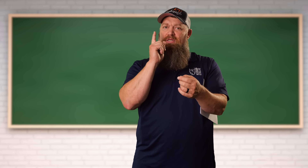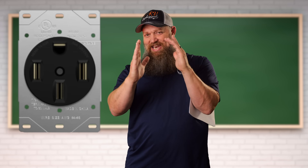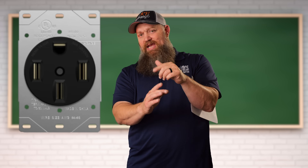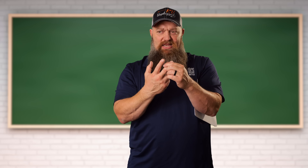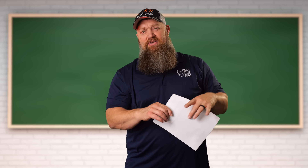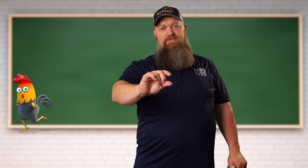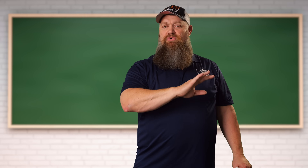That's hot leg one, hot leg two, and the ground — what you don't have is a neutral. Now if it's a four-prong 50-amp plug, you've got a left side, a right side, and another prong down at the bottom. We need to verify if that bottom prong is the neutral, and then you have your ground. If it's four-prong and one of those prongs is a neutral, you've got 50 amps on leg one and 50 amps on leg two — we just need to make sure it's hooked up correctly. Yes, you can plug into it, because even though it's split phase, there's nothing in that Alliance that runs on 240. You have two legs of 120 volts, and if you're running 120 volts you need a return path home, which is the neutral. We cannot share the neutral and ground, which is what many three-prong applications do. Do not plug into that — you need to have a neutral.